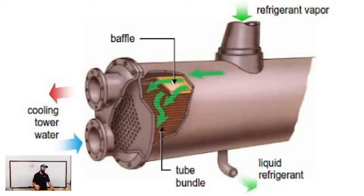Ultimately, with the way that happens, your discharge refrigerant comes in and hits the top of a distribution plate that distributes the discharge gas across the entire machine. That is very important, because if that plate wasn't there, that refrigerant would have enough force to completely displace the refrigerant in the bottom of the machine, of the barrel, and it's going to cause a lot of flow issues and efficiency problems.